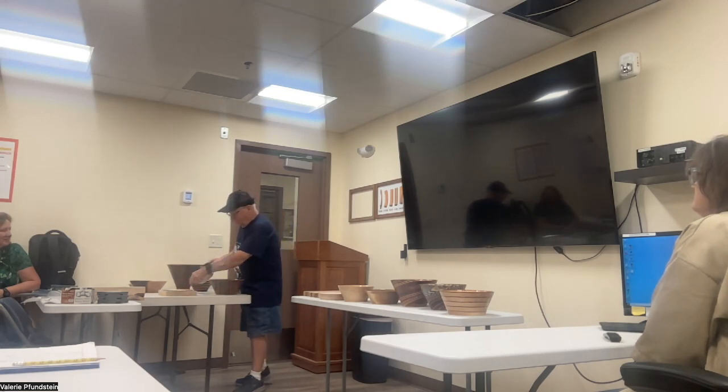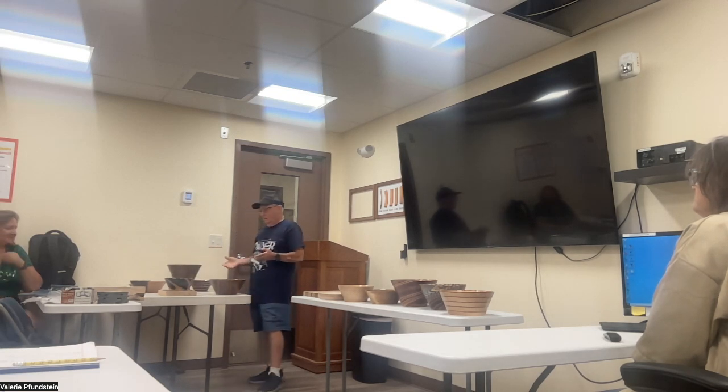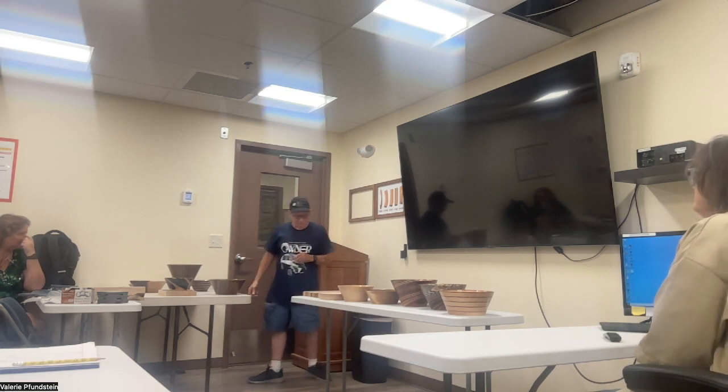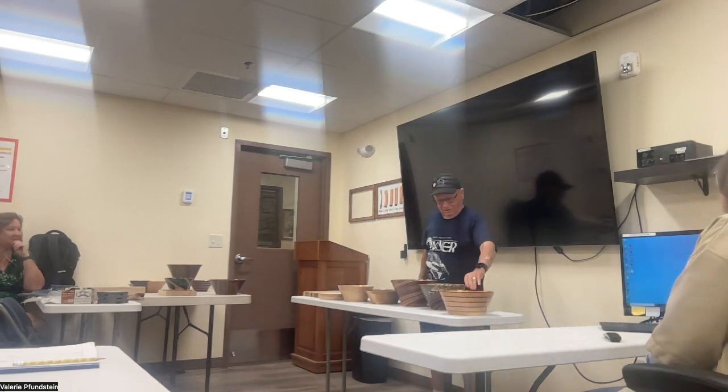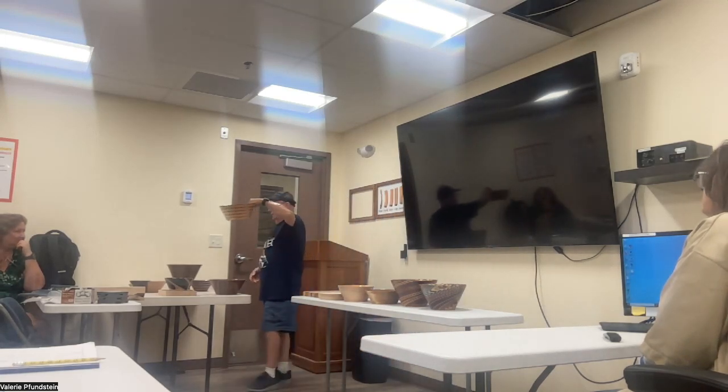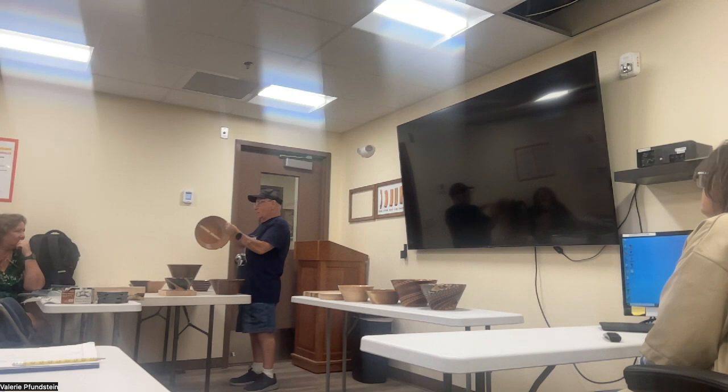Now, after you do these and you cut these wafers, I cut them up in 1/4 inches, so we're gonna have 4 wafers. Well, I'm always gonna cut extra wafers in case I mess one up. So after a while, they started piling up on us. So we came up with this idea. We take 1 wafer and glue it onto the board, and then we cut them on the Ringmaster. So for each wafer that we had left over, we get another bowl out of it. Everybody in my neighborhood has a bowl like this.